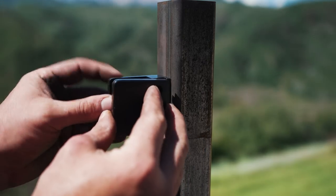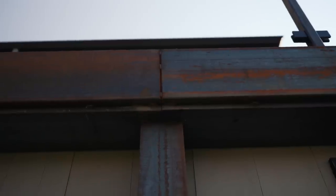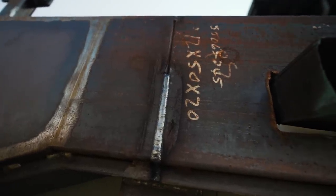The other side on. Like that. And it squishes the glass. Now I need to weld these butt joints of the channel. And I'm using 7018 for the posts. And I'm using dual shield flux core for the long 12 inch butt welds because it's just so much faster.